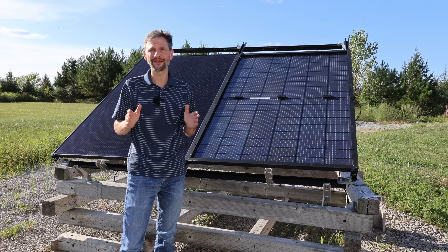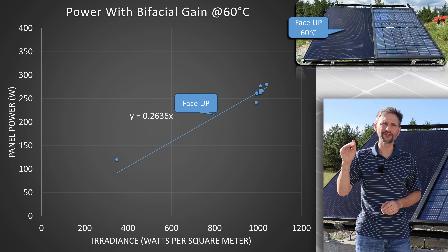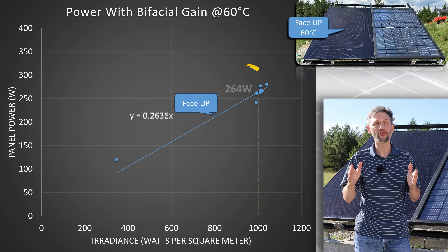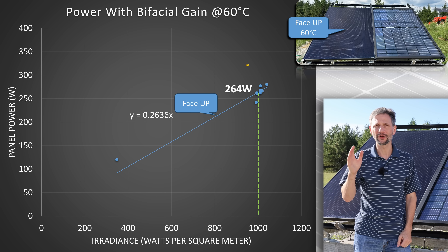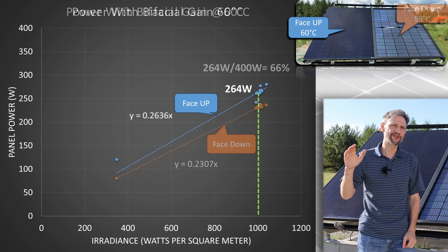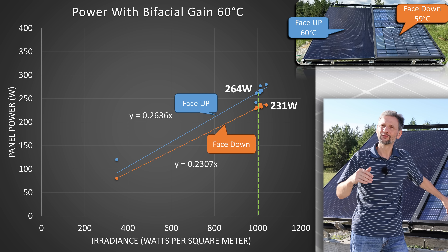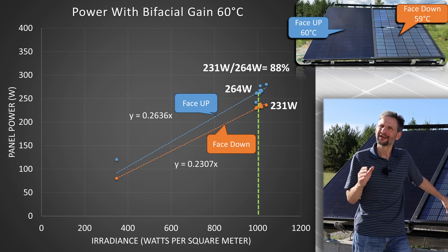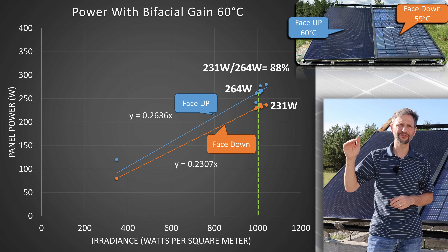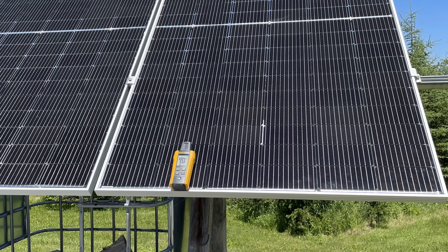Because of her help, I have some very nice consistent data sets. I started taking data with no backside blocking. The ambient temperature was 32 degrees Celsius with no cooling. The panels were hitting a toasty 60 degrees C, producing only 260 watts at 1,000 watts per square meter. Out of the 400 watt rating, that's only 66% of the rated output. Strangely, the upside down panel was producing almost the same at 231 watts, which is 88% of the face-up panel. And that result did not make sense. At first, I thought the low performance might be due to the very high surface temperatures. I checked out my bifacial SunGold power panels and they were low at 78% of their rating, but not that low.